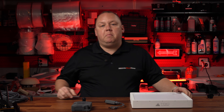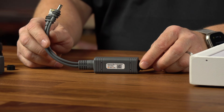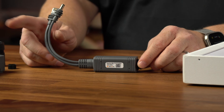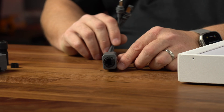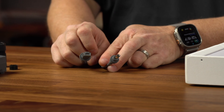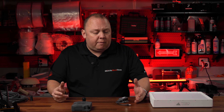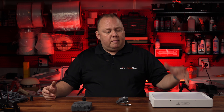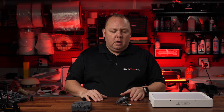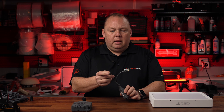So enter our DC-powered Starlink Mini kit. What you get in the kit is our PoE splitter. This is going to take PoE — special proprietary PoE that is high wattage output for the mini. It basically takes a standard Ethernet on the input side and then splits that out to an Ethernet and a DC power on the output side. The DC power here is going to be at 48 volts, which is better because at 48 volts you're running at the higher voltage levels of the mini, so you're going to have the best possible performance. It's not going to be struggling with 12 or 13 volts. We ran all this at 48 volts — just be careful in knowing that, because you don't want to ever plug anything except for your Starlink Mini into this, because it's not 12 volts. Even though a lot of people are used to seeing that as a 12 volt plug, it's not.